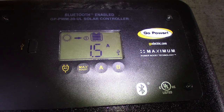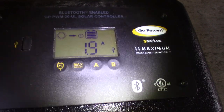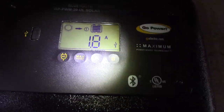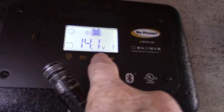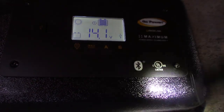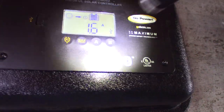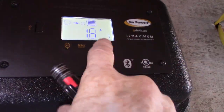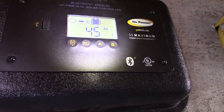Right now we're getting 1.8 amps from the sun, being converted to electricity and stored in your battery — around 1.6 to 1.9 amps. You have a flooded battery, which is just a regular deep cycle marine battery. Right now you've got 14.1 volts in your battery, which is perfect. Push button B to cycle through readings: amp gain from the solar panel, charge percentage — currently 100% charged — and amp hours showing how much storage you have. You get all that just by pushing B.